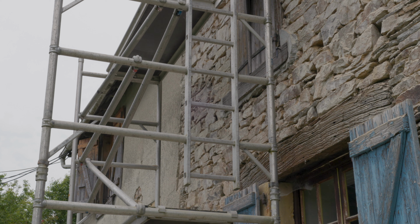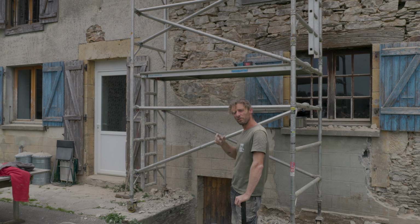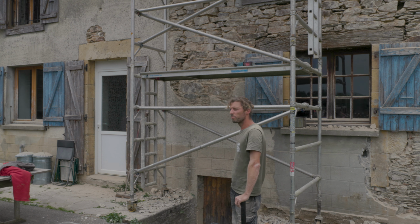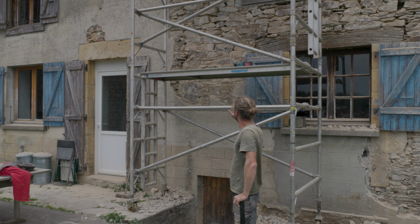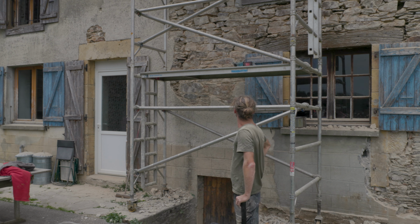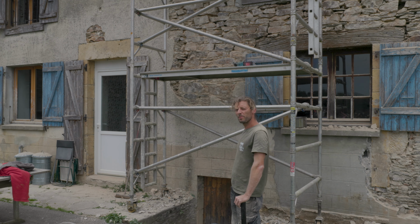Okay, on top it's all been cleaned out. I'm just removing the cement rendering, the old rendering that's still in there, or the pointing. I'm letting it be for now. We're getting rain anyways, so it's gonna clean the walls for me. And the final cleanup, to remove the old pointing, I can just do with the scraper because it's soft.